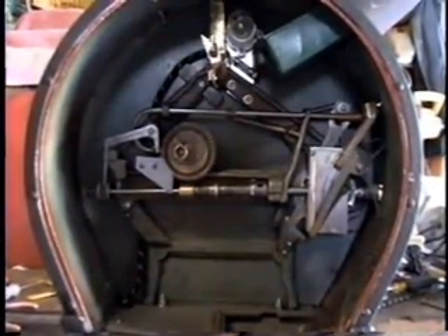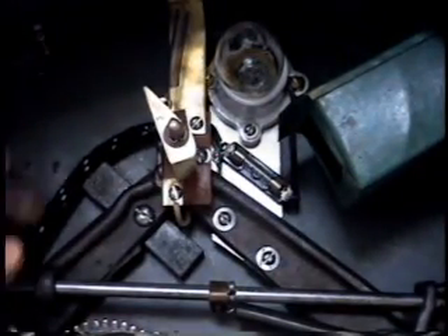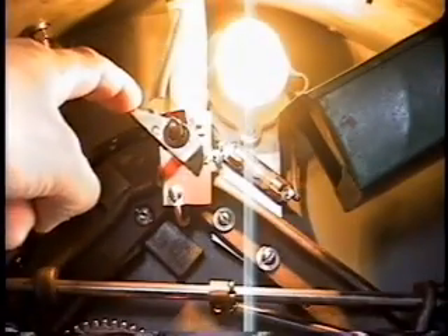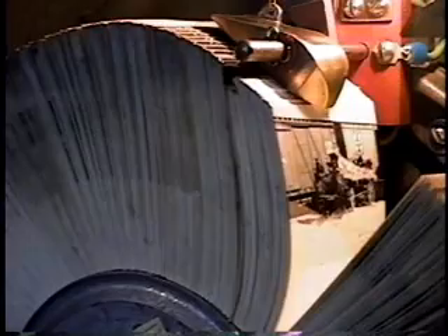Here's the mechanism put back into the housing. I decided to go ahead and rewire it again — I installed a cloth cord so it would be correct with the period, and my fuse is right here. When you close the switch, it comes on. Now the reel is reinstalled, and when you crank the reel so that it pivots that weight far enough, the light comes on and you can watch the movie play — until you get to the end. I'll show you the complete movie through the regular viewfinder that the patron looks through.